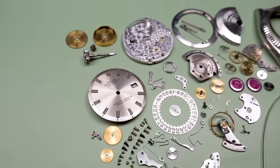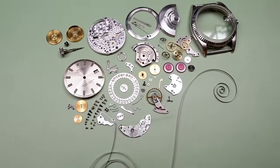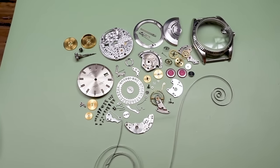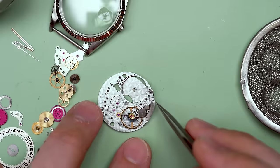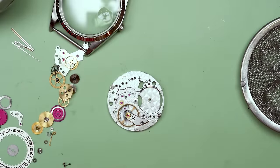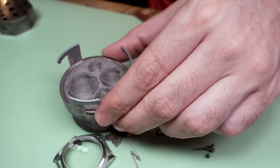Here's all the parts all laid out, and I've still got that wheel stuck on there. But you know what — that wasn't the worst, and this watch is actually in pretty good shape. With that, let's get things back together. First things first: watch cleaning machine. I put the balance back on and then start getting the parts in the basket.